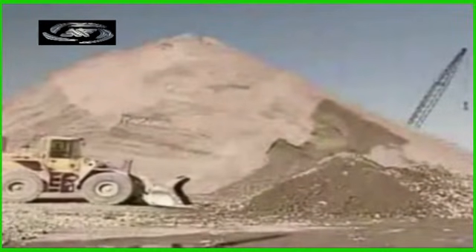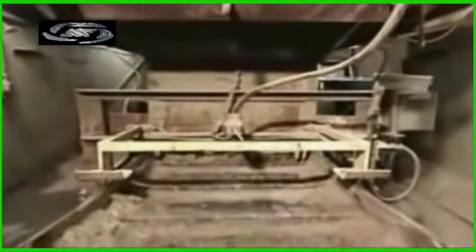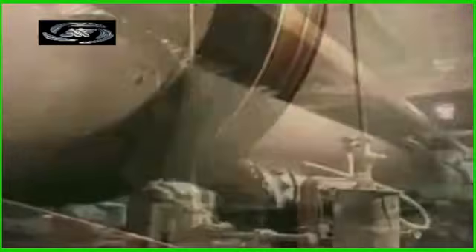The process of making gypsum board begins at the quarry, where crews mine gypsum, a soft rock. The loaders dump their haul into what's called an apron, and the apron channels the gypsum onto a conveyor, breaking up the big chunks along the way. From there, it's into a giant rotating drum. Within 8 minutes, this hot air rock dryer removes 5 to 10% of the moisture, turning the gypsum white.